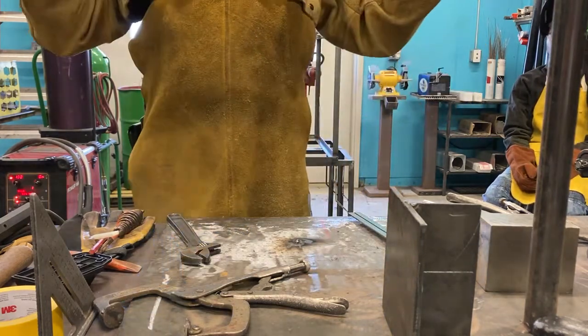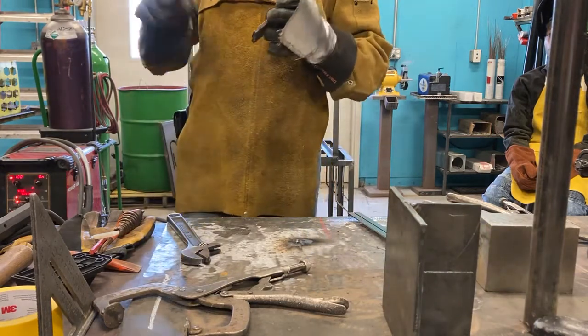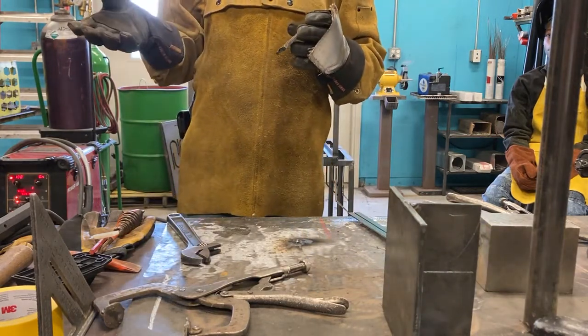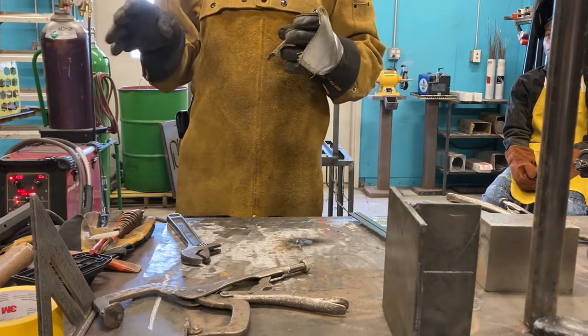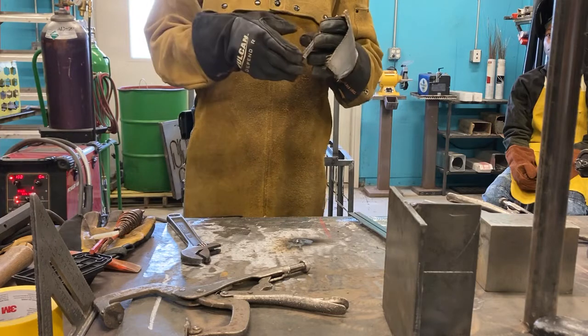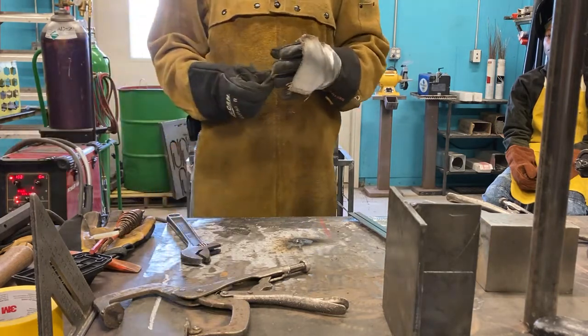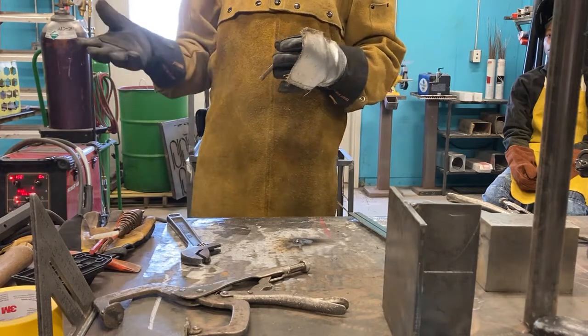You wouldn't believe the noise it makes when it hits the table. So back-breaking welds is very easy. It's a cool trick to know, but know where the welds are. It's no strength from the backside at all. Great strength from the front side, nothing from the back side. The same thing is true with 7018. Doesn't matter how strong the weld rod is, it's physics.